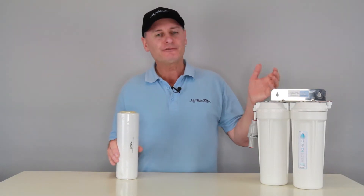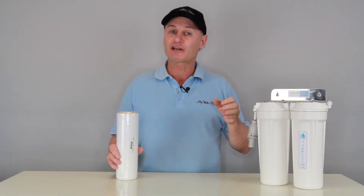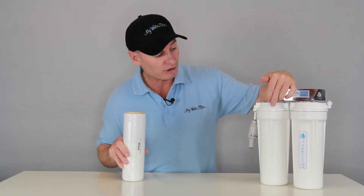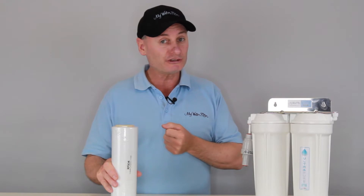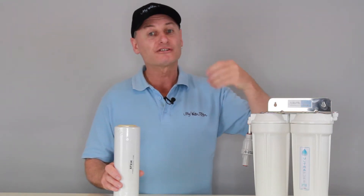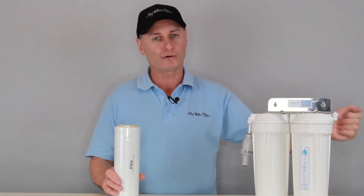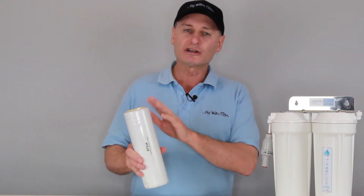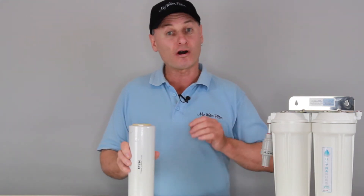So what we do with these is if you've got some water filtration outside — even just a sediment cartridge — so the tank, the pump, and a bit of sediment filtration into the house, you can just go with a twin system. Put the Calcite Corus X cartridge into position one. The water comes in, goes through the Calcite cartridge — it's already been pre-filtered for sediment outside — it'll elevate the pH of the water up to seven, flows over into the ultra-pure, stops any bugs, any metals, anything that could be in the water washed in off the roof, herbicides, pesticides, or you name it, and then we've got beautiful perfect drinking water on the other side.